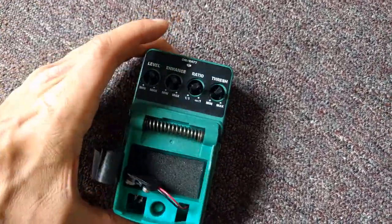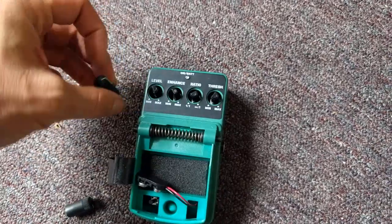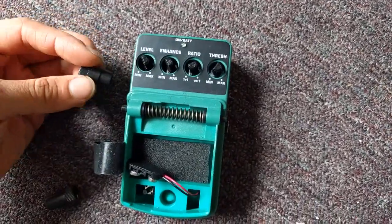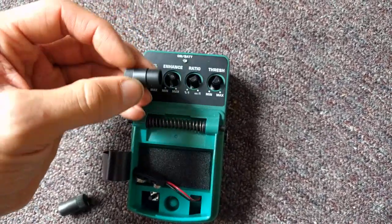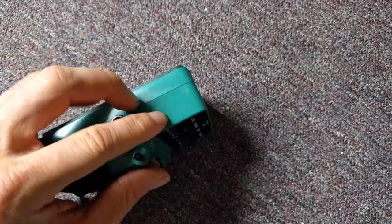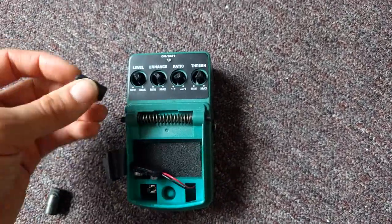If this was a really short shaft, that angling wouldn't hurt the brushing element as much. But the way this is set up, it really does damage it. The way an engineer should have made this is to lower the plastic part — the Z height — down to almost where the mold line is, or just a little bit above it. They didn't do that.